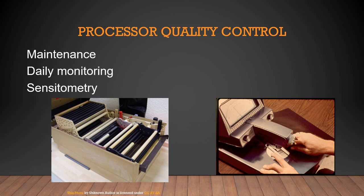Processor maintenance: scheduled maintenance involves routine procedures performed weekly or monthly, such as taking out crossover rollers, rinsing and cleaning them. Preventative maintenance is planned maintenance at regular intervals — a service technician would replace all movable parts inside the system. This prevented non-scheduled maintenance, which meant something broke and required an emergency repair.